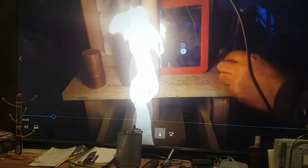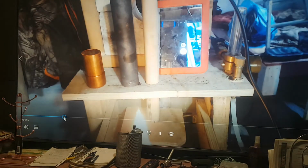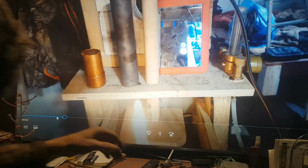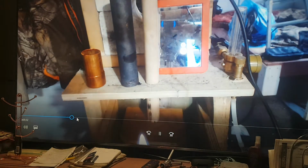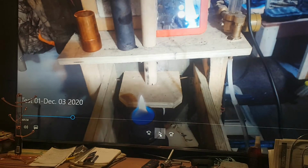That's a good view of the flame. I'm going to try to turn the propane down a little more. What we're trying to do is get the yellow to shift into a blue cone. It's a really good transitionary state visual. And the camera's not on. All right, so you can see where the yellow flame is going away.